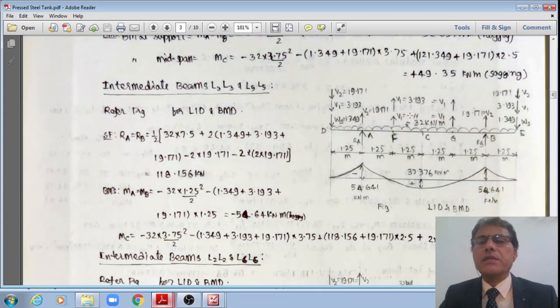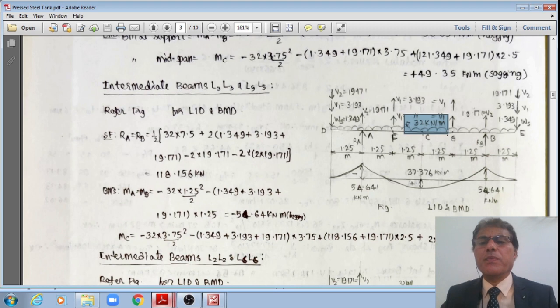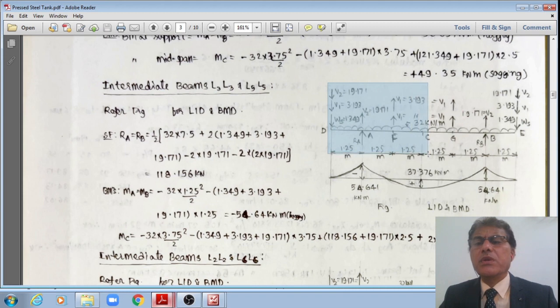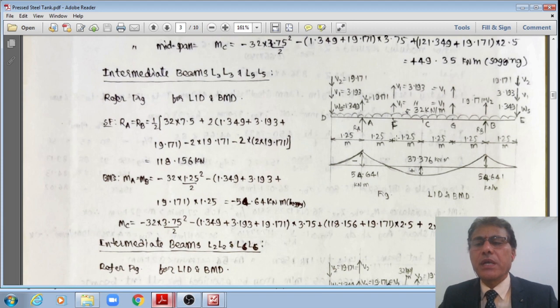1.349 kilonewton, and the intensity of the UDL is already calculated for 1.25 meter panel width. That won't change, right? That is all 32 kilonewton per meter. Then this loading, once you draw up to the mid span, the remaining is just a mirror image, students, right? The remaining is just copy and paste as a mirror image. And each of these lengths is 1.25. There are six such plates, and let the joints be given by A, B, C, D, E, F, G respectively at